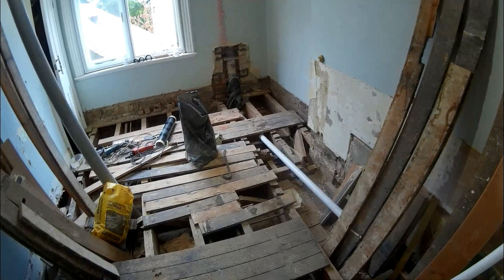So that's the way I've decided to do it, and I think it's the way that will cause the least trouble and the least hassle, because I've used what's already there, or I've drilled through the least amount of joists possible, which I think is the best way in a situation like this. And then later on we can start to think about filling in some of these notches.